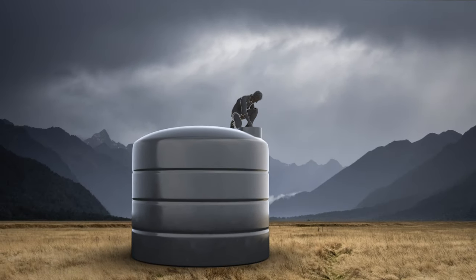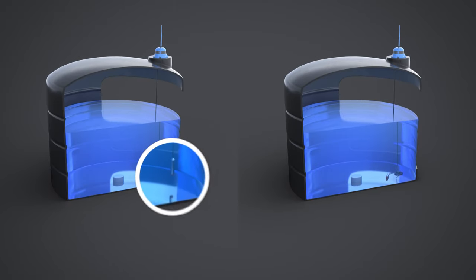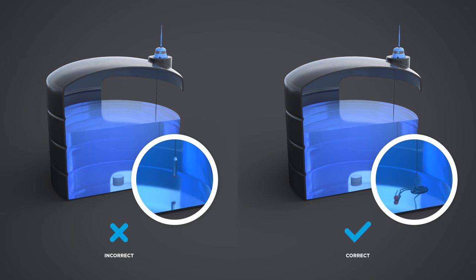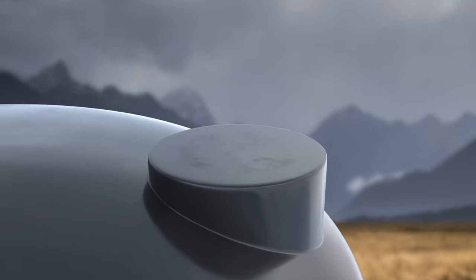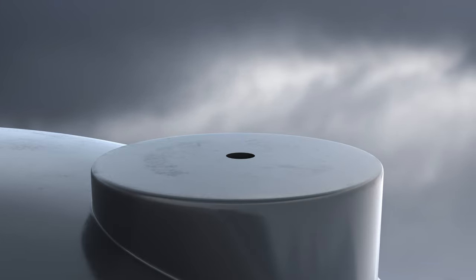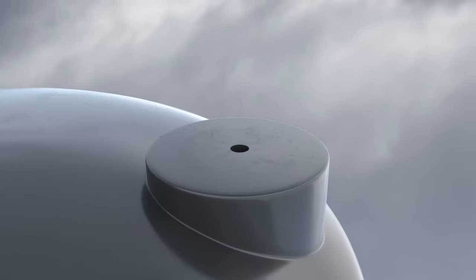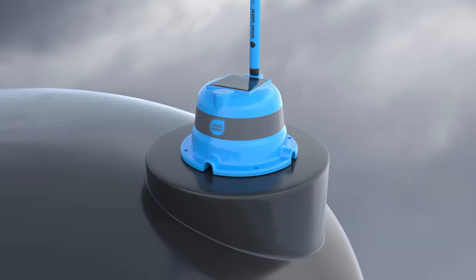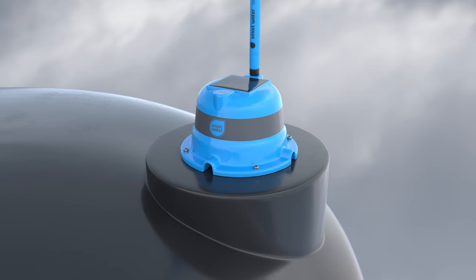Take the tank sender and sensor cable to your tank. The sensor should not be suspended — any excess cable can be lowered into the tank. Where possible, position the sensor well away from any outflow fittings. Find an opening in the tank or create an opening with a minimum diameter of 32mm for the sensor body to fit through. Gently lower the sensor until it rests on the bottom of the tank. Please note the sensor is a precision-measuring instrument and is sensitive to knocks and damage — it should be handled with care at all times. Secure the tank sender to the top of the tank using the screws provided, or alternatively an adhesive can be used. Ensure the tank sender has maximum exposure to sunlight and water can drain from under the unit through the drain vents.